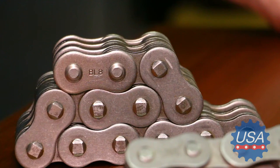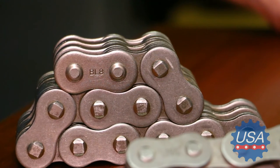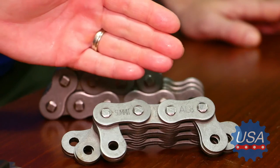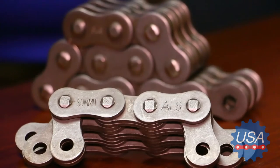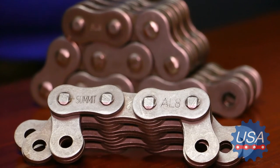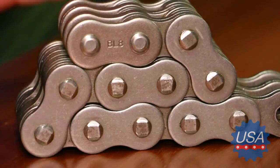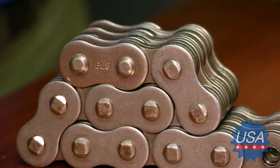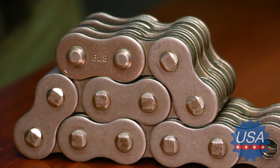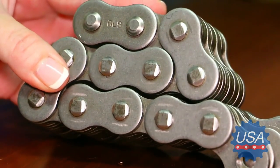First of all, I would have them take a look at the side plate of the chain. There are usually some letters or numbers there that will help us ID the series of the chain. In most cases they are stamped with an AL or BL followed by a number. The AL indicates a lighter-duty leaf chain with a plate thickness of the same corresponding size ANSI roller chain, and may not be suitable for heavy lifting applications. The BL indicates heavy series and has a side plate thickness of the next size up corresponding ANSI roller chain.